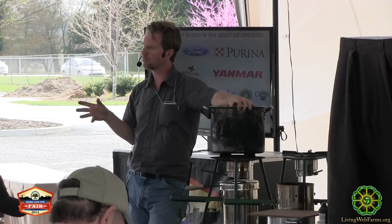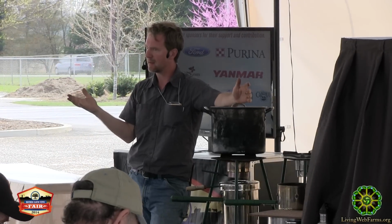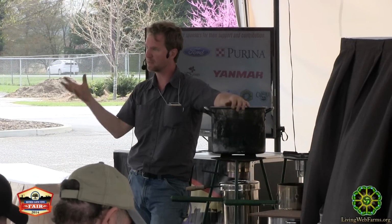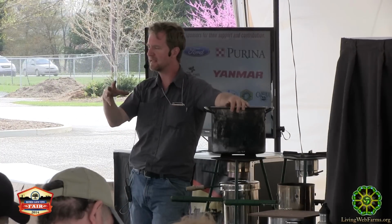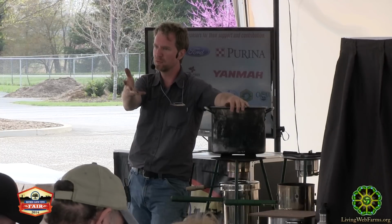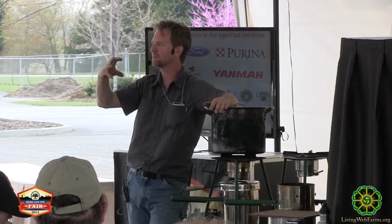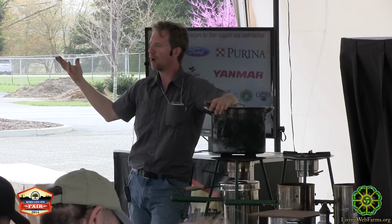You know what a retort is? A retort's a fancy word, for those who don't know, which is basically a semi-sealed metal container that has wood in it, and you add heat from an outside source. You can actually run flue gases through the chamber, or you can add heat from the outside, and you're heating that wood until wood gas starts pyrolyzing off of the wood.